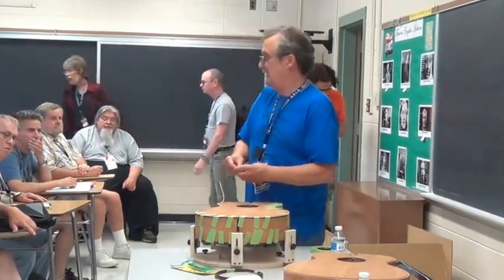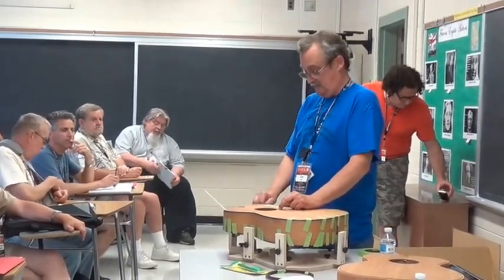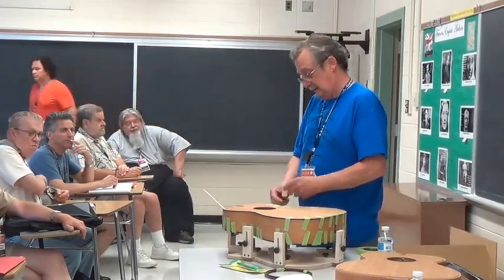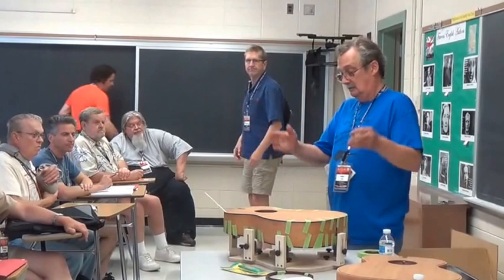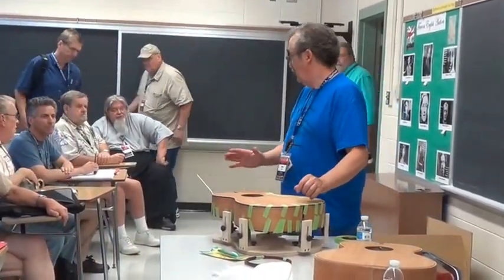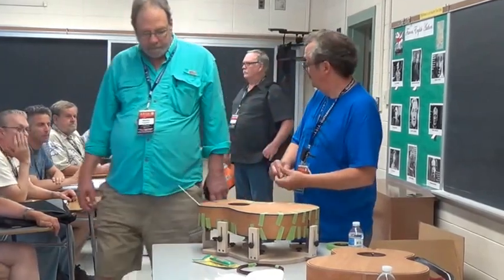Now, I do use my binding machine that you're probably familiar with on eBay and my Kit Guitar Forum and YouTube. So because of the tool issue, we aren't going to run that tool, but you're welcome to stop by my table and I can explain how the routing process works. The binding machine will hold my router perpendicular to the table. This little contraption here allows me to adjust my table so that I am always perpendicular and have my top parallel to the table, even when I do the back. Because the back has a radius, and it's also set at a taper.